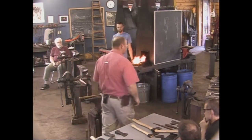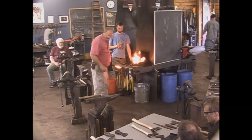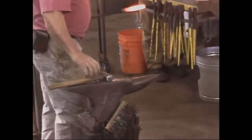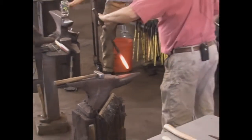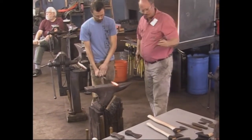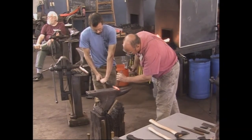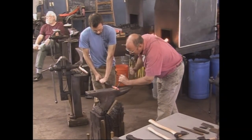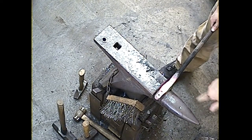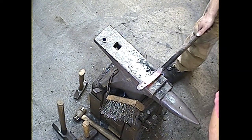There are two ways to do that burring. One way is with a square-ended chisel like an engraving tool — come in from the side and raise a burr there. The only reason I don't like this is if I turn it over and do it on the other side so I've got burrs on both sides, then I flatten these out. I've done it in a wooden block, but you get so much flame and smoke in a wooden block it's really hard to see what you're doing.